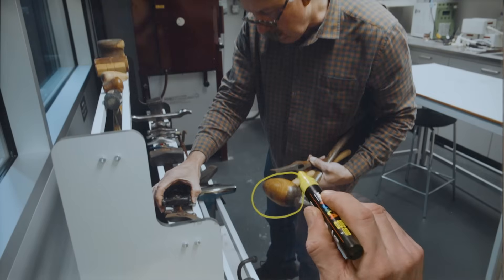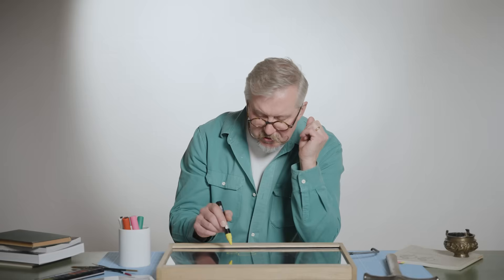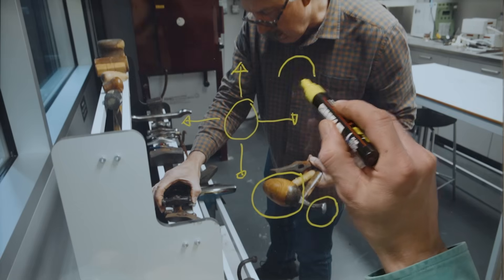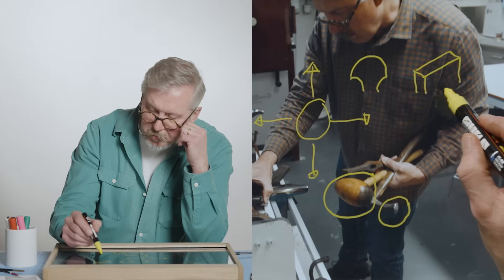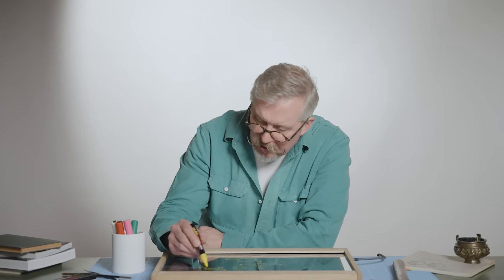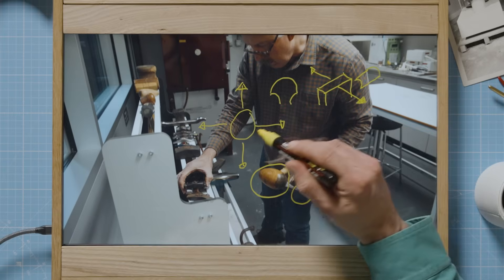You can see I have a wooden mallet here. This is for ironing out the heavy blows or dimples formed in the metal when I use the raising hammer — it smooths out the deep blows. Various hammers move the metal in various directions. A round hammer, which has a domed top, pushes the metal in every direction. A hammer with a flat top pushes the metal in two directions only — that way and that way. With a raising hammer you don't want any sharp edges because that will cut into the metal, so raising hammers tend to have a smoother appearance. You can steer the metal with a raising hammer and have more control than with a round hammer.